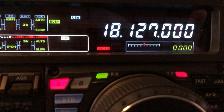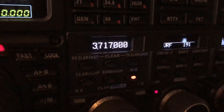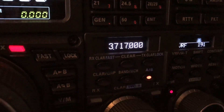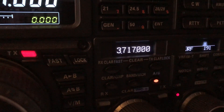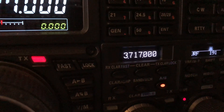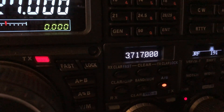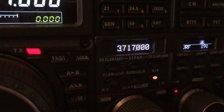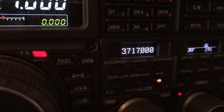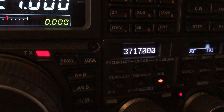I'm on 17 meters and the VRF is not engaged at this point. I do have it set at 191. On this band there are 20 different options of LC networks you can switch in. VRF is Variable RF Front End Filter, and essentially it's just narrowing up the pass band on the front end of the rig. It's not gangbusters like the external micro tuners you can buy for these rigs, and certainly not going to compete with the FTDX101's Variable Capacitance Front End, but every little bit helps, right?